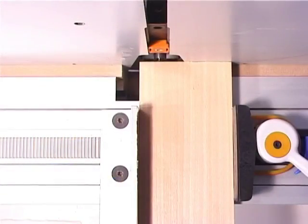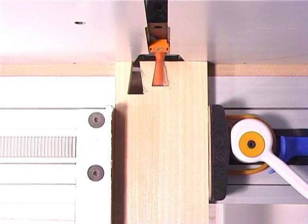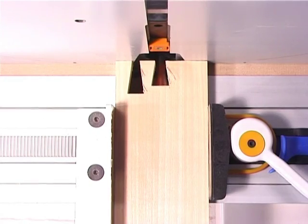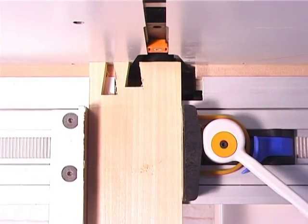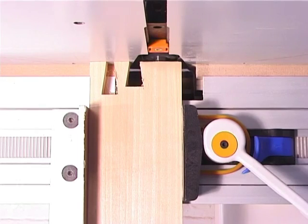The first cut is Woodrat's DC5. It'll cut up to 32 millimeters deep, even with the smaller router. The second cut is with a TCT cutter with a larger width across the base, but notice that it only cuts 25 millimeters deep. The third cut is nearly 25 millimeters deep with Woodrat's DC4, but compare how slim the cut is.